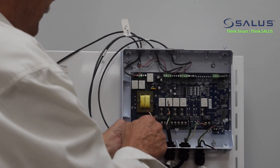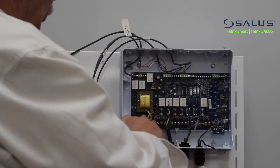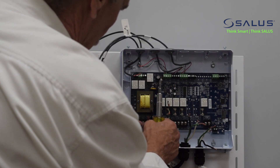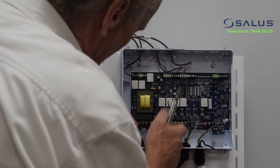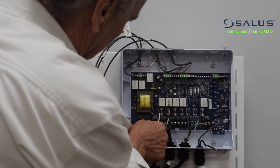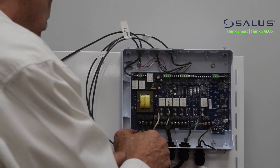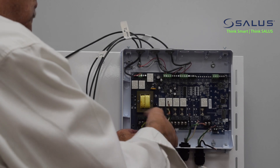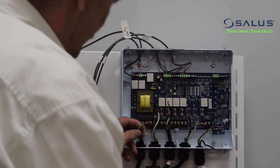We bring the 115 in — black for power, white for neutral. One of the nice parts about this panel is it actually has a ground terminal. You do not have to just tie everything together with a wire nut; you can ground everything specifically so you have a good positive ground. Grounds are very important in today's equipment.